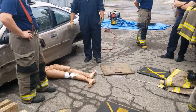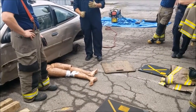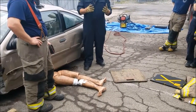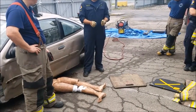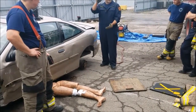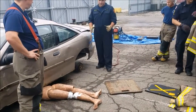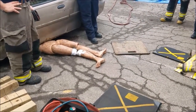People have asked about using the spreaders to lift a car. That is an option, but it wouldn't be my first choice because while it's quick, it's not good. In New York City, they killed a guy — they had a man on a moped run over by a Ford Taurus, laying face down in front of the rear tires with a helmet on. Bystanders with cell phones were talking to him, the guy was alive. When the crew tried to lift the car with the spreaders, the spreaders twisted out, the car came down, and killed him. Airbags are far better.